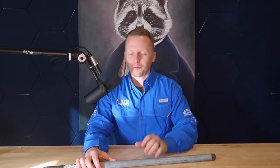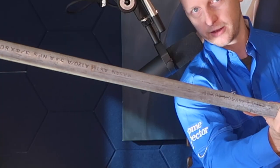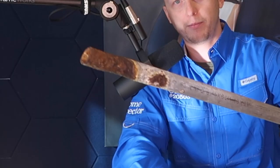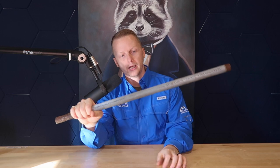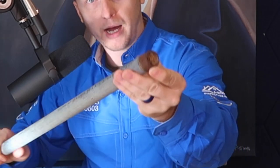How do you find out if your pipes are bad or not? It's really hard to tell unless there is exposed damage, because on one side of the pipe it can look perfectly okay, but on the other side it doesn't. The only ways you can really tell are through low water pressure at the fittings of your pipes and the rust-like color coming through your water.